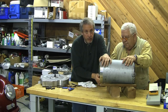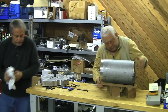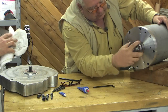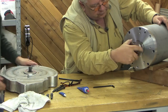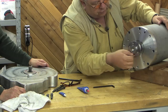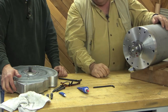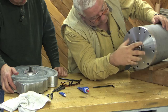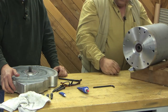With that thread locker on — and thanks for reminding me — I think that's pretty good. Let me swing this around where they can see it. I sure like the look. There's a little lash in the coupler, but the motor spins quite smoothly. If we had any alignment errors in our end plate, since that end plate and this one hold the rotor up by those two bearings, we should be pretty much jammed up. That bearing cup is holding that rotor bearing, and I think this thing just looks a lot better.